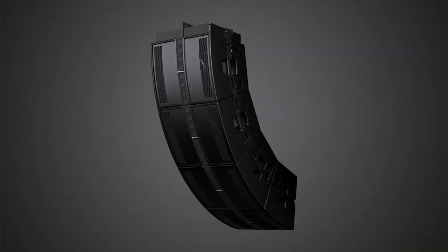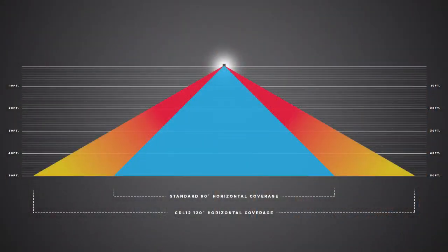We really call this a hybrid — it's in between a point source and a line array. Line arrays have been very popular because they allow you to get louder over distance. How we closely coupled all these 2-inch drivers makes it really contain that energy to make it nice and smooth. That's why we call it constant directivity — like a CD horn that a lot of people may have used. It makes it nice and symmetrical with even coverage in the horizontal and in the vertical.